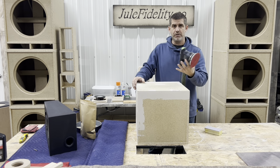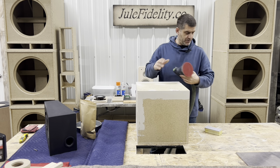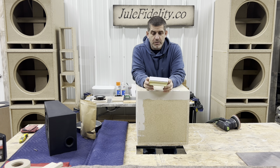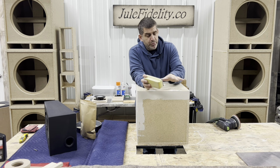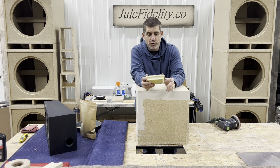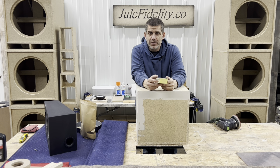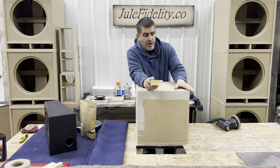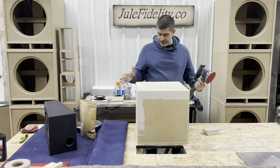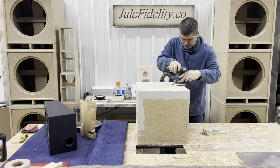I got busy and it's been a couple of hours — it looks pretty dry; we'll find out when we sand it. I'm gonna use an orbital sander with some 220 on it — no soft pad, nothing. If I'm gonna hand sand, I use 120 to get it basically pretty close and then come back with 220 to smooth it out. You could just do it all with 120, but you don't want to start rounding edges on your wood.